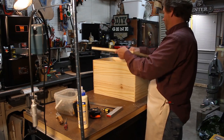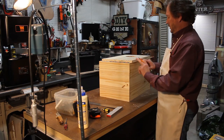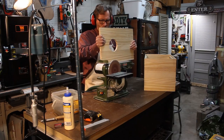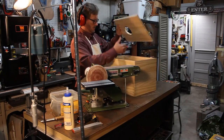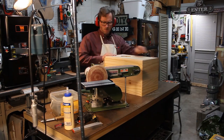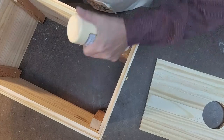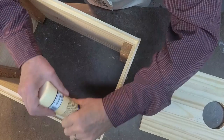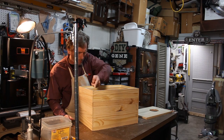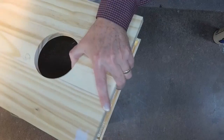We're going to install the face on here. It's a little bit tight, so I'm going to mark that edge and use a sander to trim or smooth it down — really not very much needed at all. Using the same method as before, I'm laying a good heavy bead of glue around all the sides. A lot of times people use a brush to spread it, but I have no problem running my finger around to smooth and smear it into all surfaces.